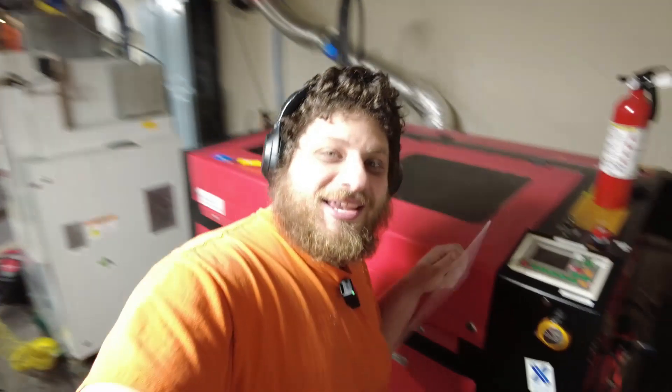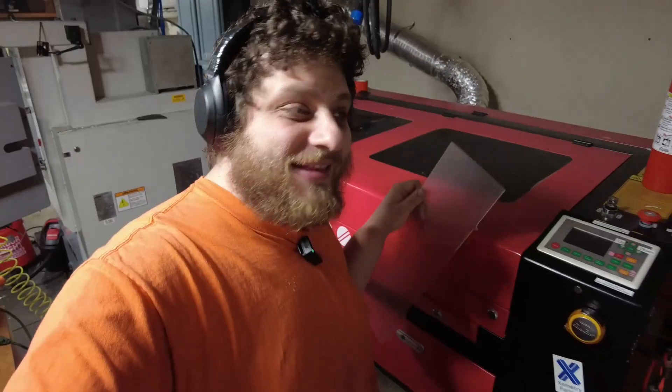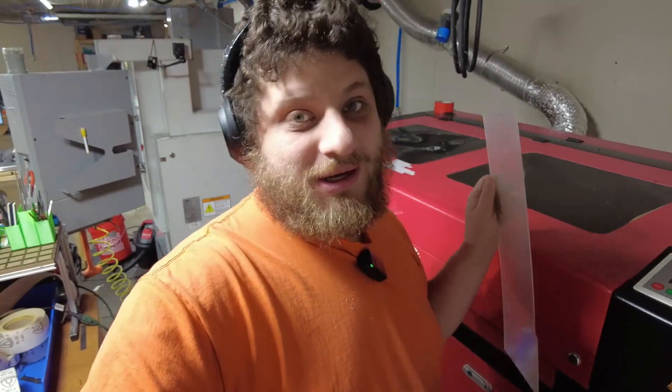And then there's how I cut my materials: a CO2 laser. This is the fastest, easiest, most precise method — gives you the best cut quality and is the least likely to leave a burr or crack the material. It's also the most expensive by far. I happen to have this 100-watt Chinese unit and it's fantastic for preparing acrylic or polycarbonate materials for the mill.